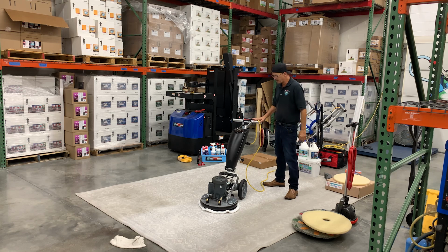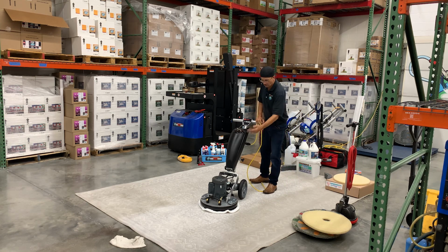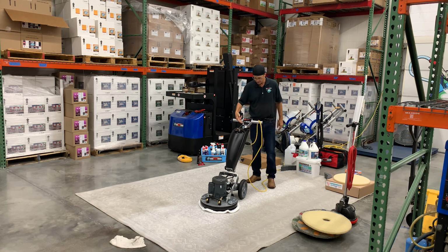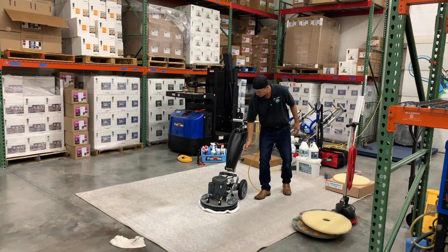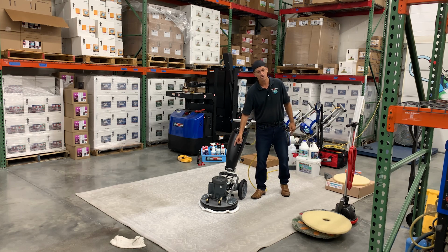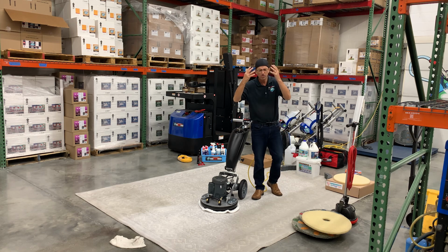And to recap the machine, remember, you can clean with your AGI pads. You can follow back up with your bonnet to get yourself some extraction. You can put the product in here through the top. You can pre-spray a little bit of your areas if you want to. You can fill it up through here. You've got your momentary switch, your on and off switch, your safety switch. You can unhook the cord here. If you have some type of electrical problem, hook it up direct down there. Remember, it's going to cut right on, of course. So plug it in here and then plug it in over your switch there while somebody has the handle on it, and you can finish the job. So they've really, really thought it out.